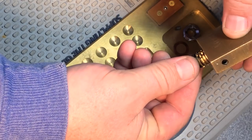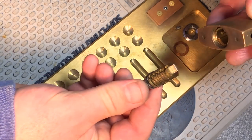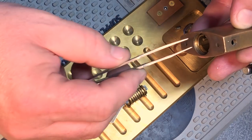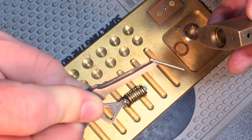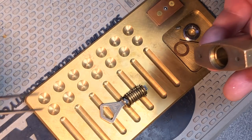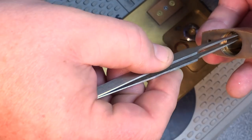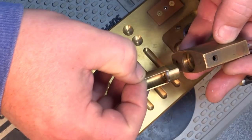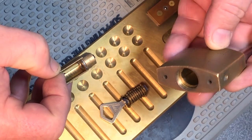I've been dreadfully inconsistent in how I've been able to take this lock apart. Sometimes the entire assembly slides out cleanly, and other times it's like this where the discs come out of the little lock sleeve. Anyway, here's the sidebar - it's really just a round piece of stock. Here's the groove cut into the lock body for the sidebar.